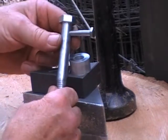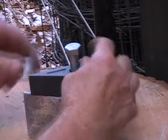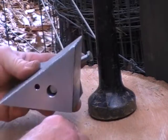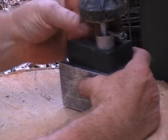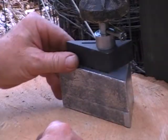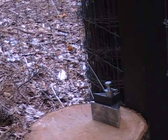this is the simulated bolt here with the handle, piece of aluminum that it's going to slide through. These are just spacers here. There's enough gap underneath here so that it'll have about a 1/4 inch of travel. Got it set up. Now, when I raise it up to that same mark, it's 24 inches, 16 pounds times 2 feet, it's going to give us 32 foot-pounds. I'm going to try and catch it on the rebound, see what happens. I'm going to take a look through the viewfinder again. Up at 2 feet. Here we go.